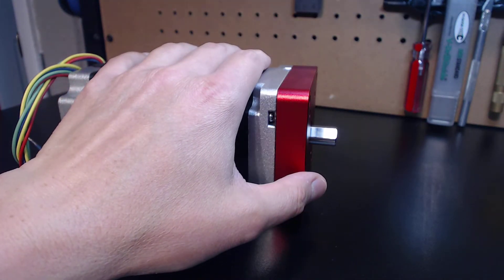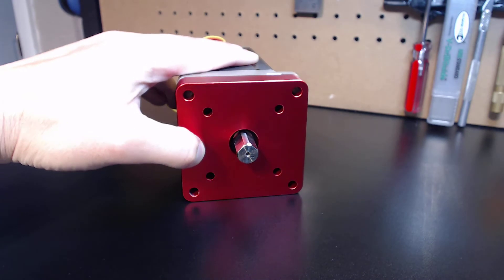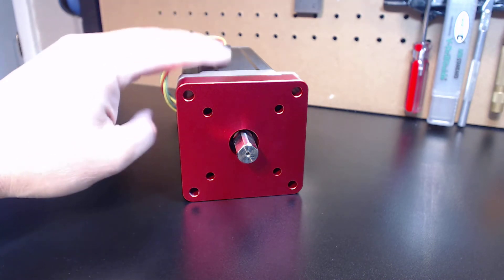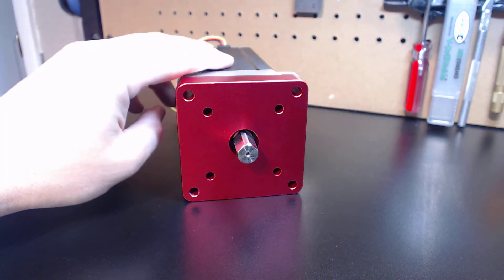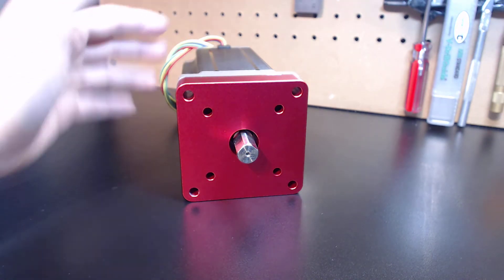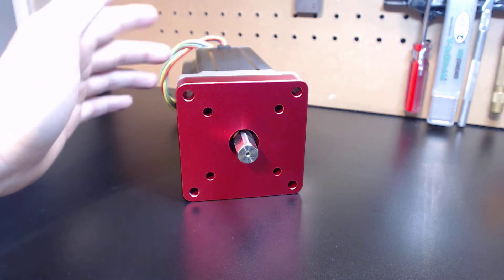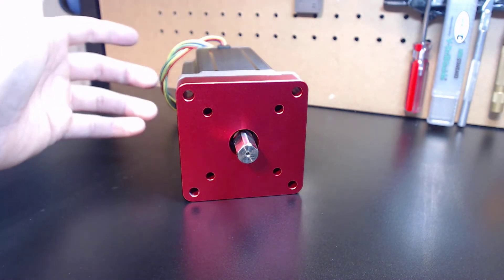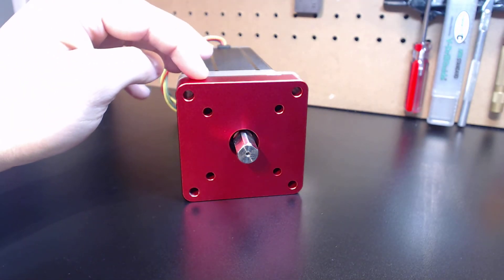I can definitely help with the hardware once I know what I'm working with, but the adapter plates are the key. If you want to extend machine performance, going from a NEMA 23 to a NEMA 34 is a night and day difference. For virtually all applications, these motors can easily machine a full-scale engine block with ease. So if you're working with steel, if you're looking to take a machine to an entirely different level — I've had clients take NEMA 34s and bolt them to a 60-40 chassis, which I used to think was crazy. But depending on how guys are rebuilding and making their chassis more rigid, it's really a question of what your design and imagination is.